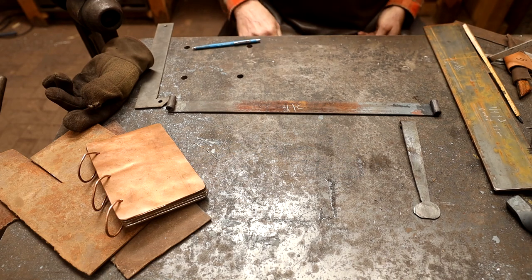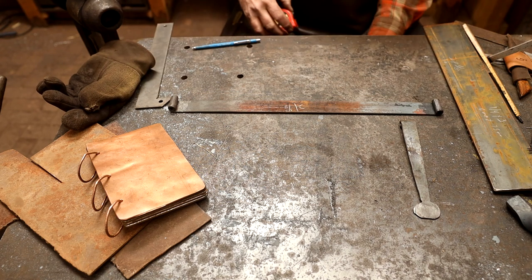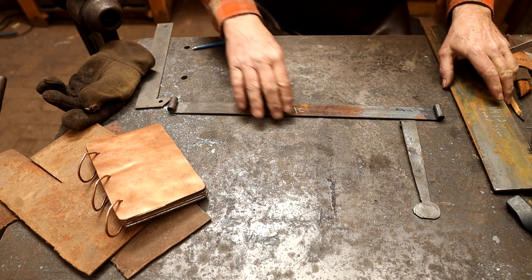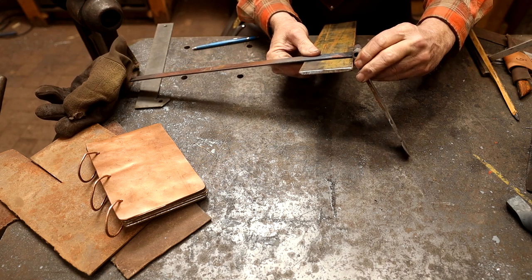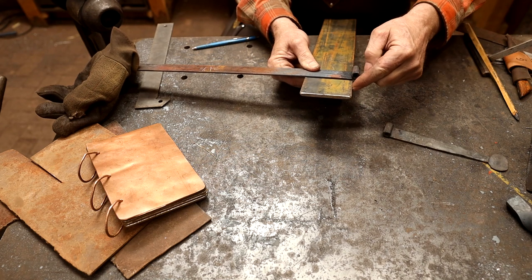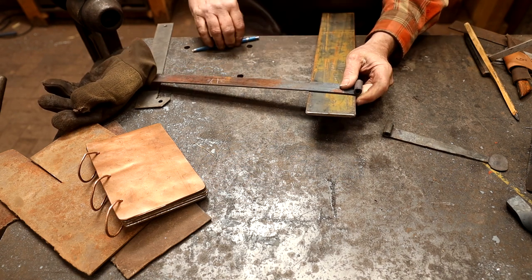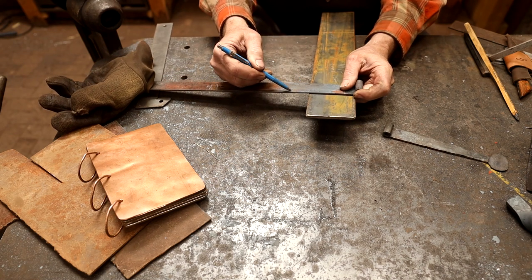I started off with about 21 inches — now I'm down to a hair over 18. That is 3 inches lost in this length, so it's an inch and a half per eye. I look at this with a mock-up hinge — I know that for everything to work right, I want the edge of the eye flush with the spine, and that will make the cover also flush with it on the inside. So that means I want 3 inches from here to here, plus an inch and a half to make the eye.